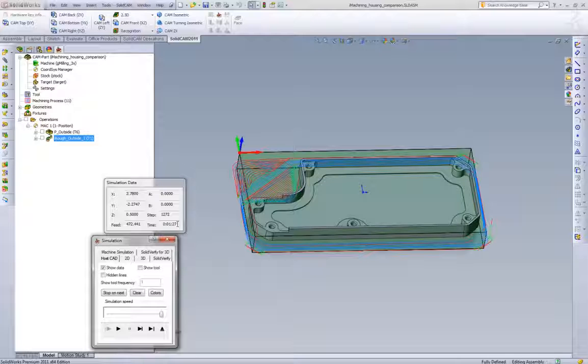So with iMachining, you have a huge range of strategies that you can go with. You can run the same feeds and speeds that you run normally, and you'll still get better tool life, more efficient cutting, and better on the tool and the machine. With SolidCam's iMachining Wizard, even level 1, 2, or 3 is going to beat the cycle time of what most customers are doing with machining today. And it's very easy, as we see going up to level 6, 7, or 8, to achieve those feed rates because iMachining is managing all of this stuff.